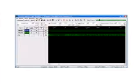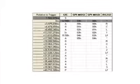Here it's connected to one single connector hooked up to the transmit data line. It can also be broken out into a table like this, where you have when the event was triggered and what values are coming across. If you look at the RS-232, we see line feeds and commands. That's pretty cool.